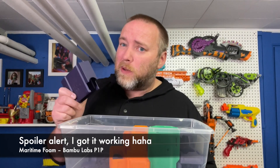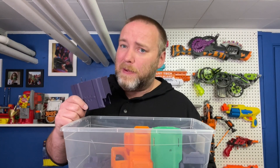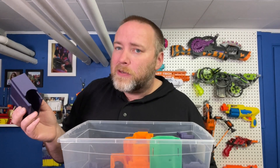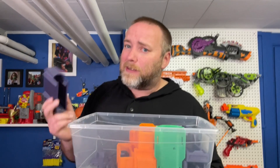Future Anthony here — sorry for the printing noise. Save yourself some grief and check the chapter markers for two of the biggest problems I ran into. Problem one: I didn't actually go through the load procedure for the filament. Problem two: I didn't have the right build plate selected — there's a dropdown, and the cold plate was the default. This is the textured PEI plate. Doing those two things might save you some time.